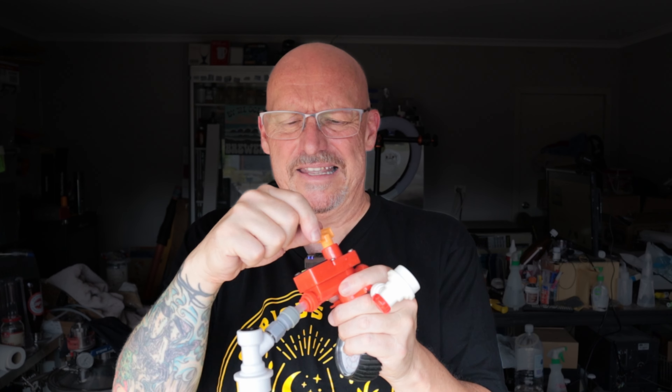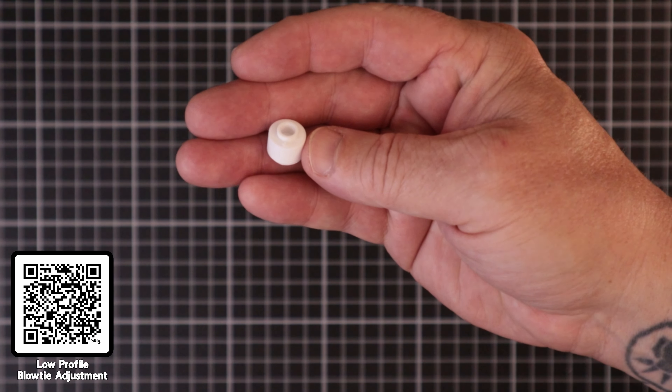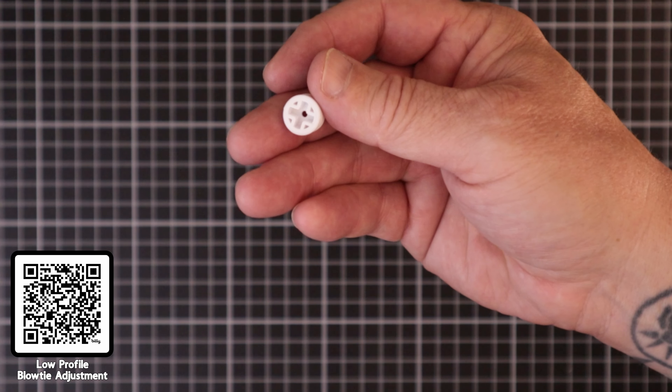I always adjust these in place. I don't think it's right to have a fitting where you can hook this straight up to your gas bottle and try to adjust it there — I don't find the pressures match up. There's too much pressure straight from the gas bottle and it doesn't work. I always think it's a lot more accurate to put pressure in the vessel you're using, close this up, stick that on your vessel, and then adjust it to the pressure you want in position. You'll find it way more accurate and it just works.